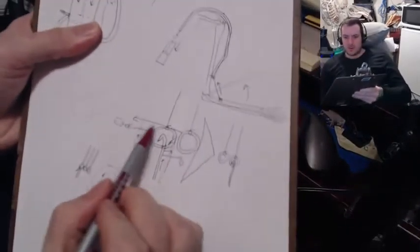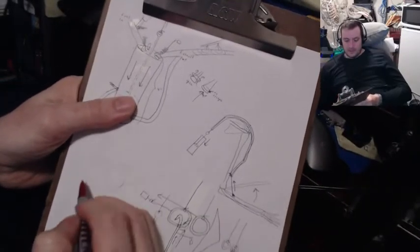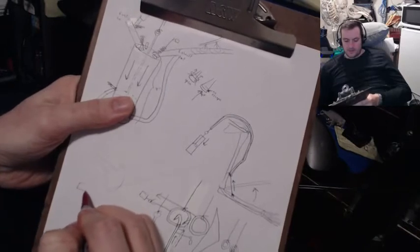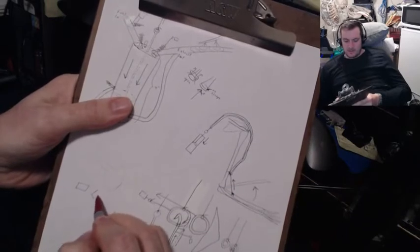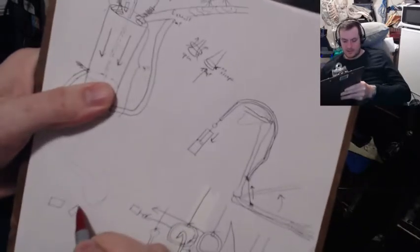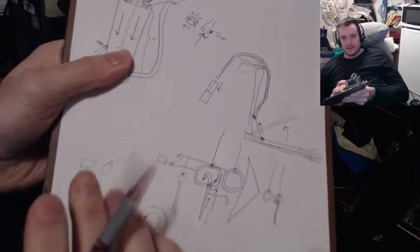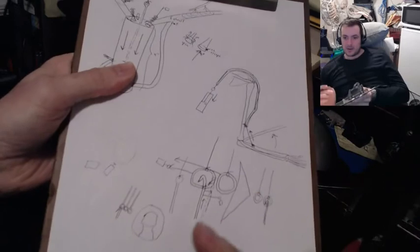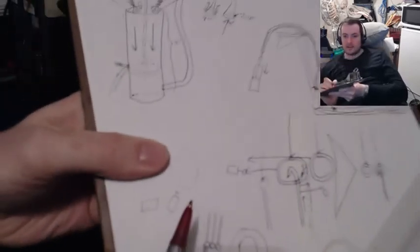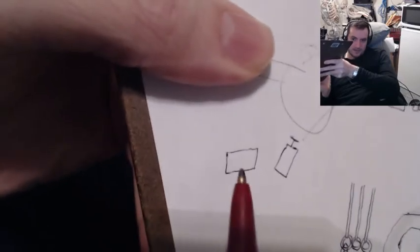The servos are just going to be pulling the hooks left and right. And a servo, so like the control board for a servo is about that big, and then the servo motor is about that big for the tiny. When I buy a servo, I take the motor and the control circuitry out of the box, and I get rid of all the gearing. You don't need the gearing for this. So you're looking at about that big. Like, here it is next to my thumb. Tiny little servo compared to my thumb. Tiny servo, tiny servo controller.